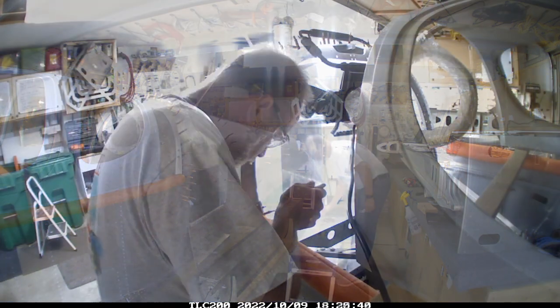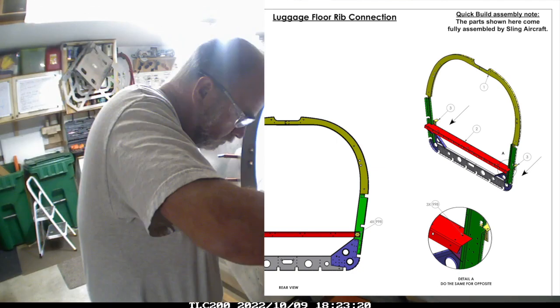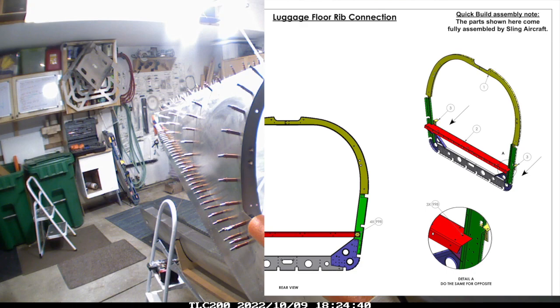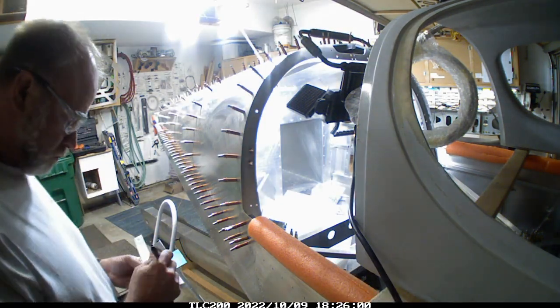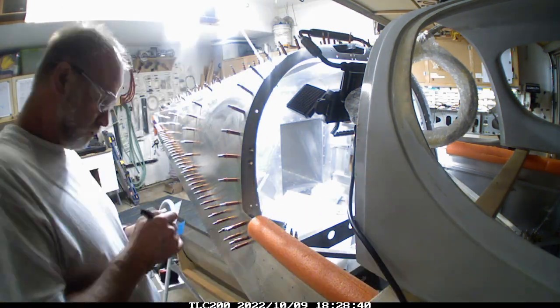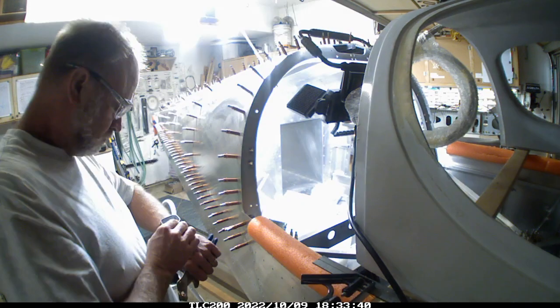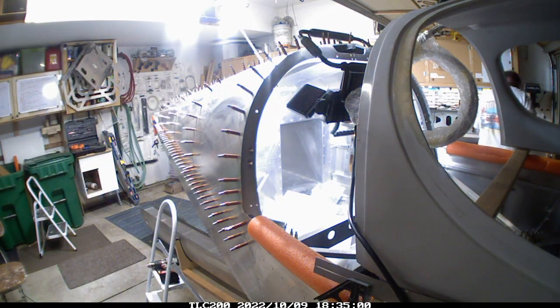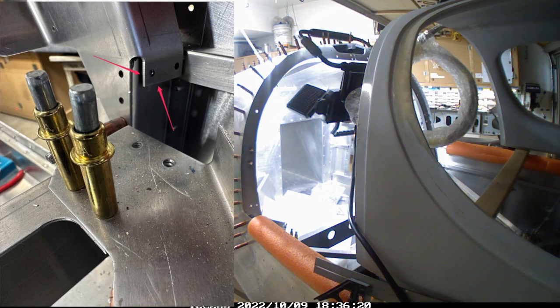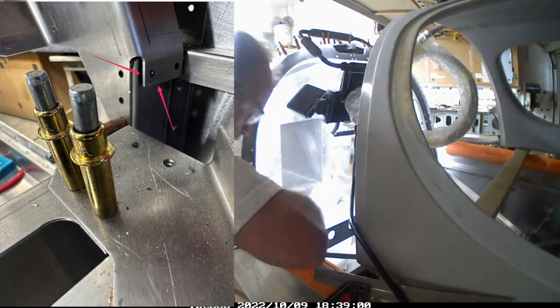Here's the problem I was running into. If you look at the drawing on the right-hand side, there's a C-channel that is the green section there, and that's exactly how I did it — the C-channel portion was pointing forward. But when you go to put the rear seat stops in place, there's a piece that goes in there, and there's an open section where you can see the arrow. If you look at the actual part there's holes going all the way across, so there's nowhere to really attach them. It just didn't fit right. I spent a fair amount of time evaluating whether I'd done something wrong or installed it incorrectly. You can see that gap — only that first rivet hole would go in, there'd be nothing to attach that second rivet hole to.